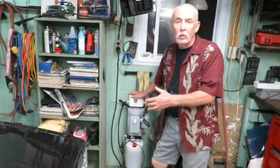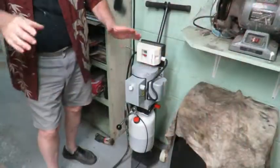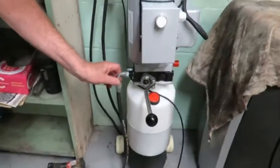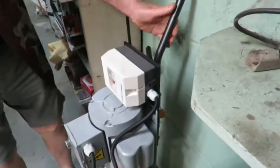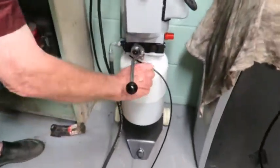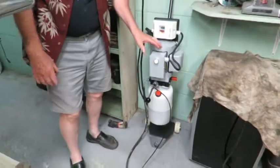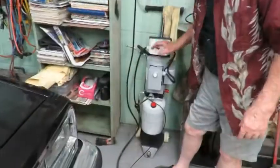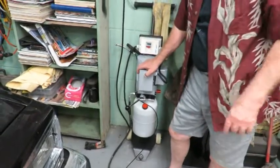This is the power unit, very similar to almost every scissor lift car hoist — this is what they call a mid-rise. Once you get it out of the package, the only things you have to do are screw this line on, put this bolt and arm on, secure four little bolts at the back, and slide the release on. Pour the fluid in and after that you're ready to go — it's just plug and play. The red button is off and the white button starts to lift it.